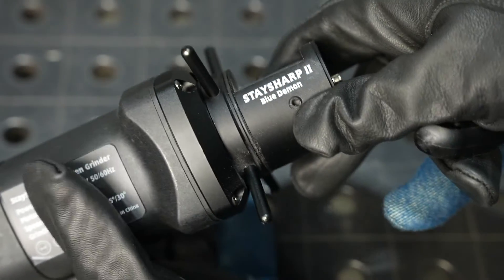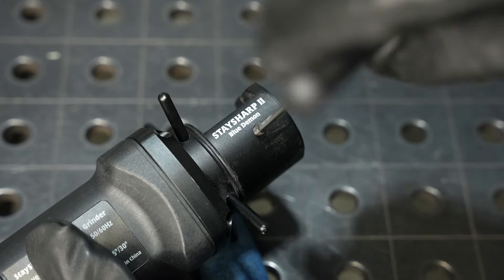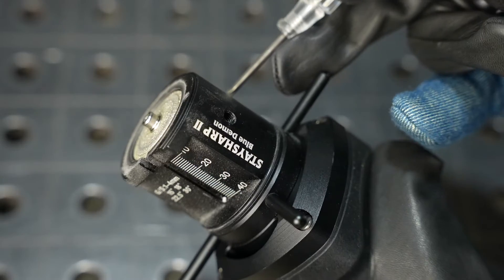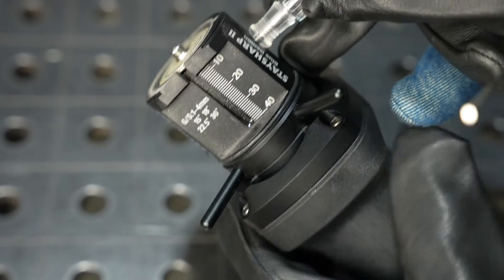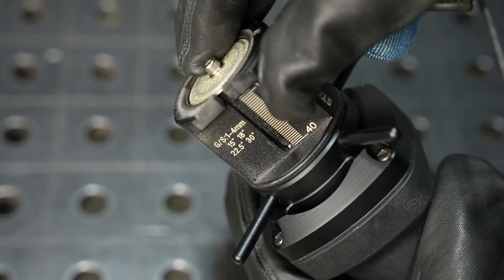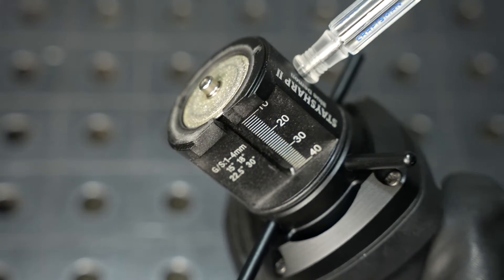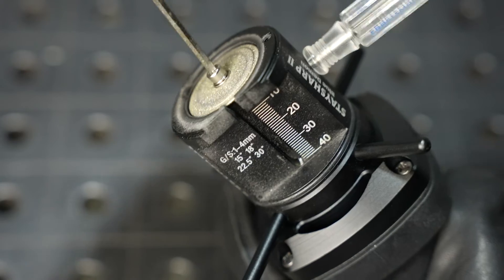In order to prevent rotation of the wheel there's a set screw in the side. By removing that, you can install a pin or a small screwdriver to prevent the shaft from rotating, and then remove the screw that is retaining the grinding disc.